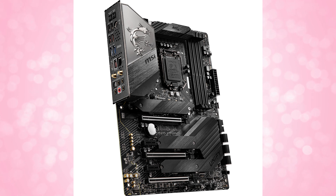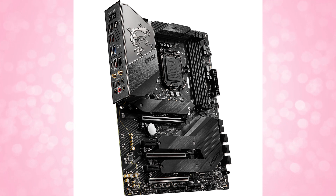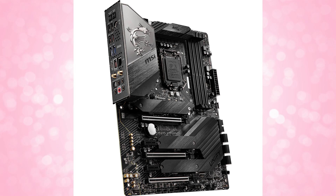While you do have your motherboard inside your computer that has a bunch of integrated circuits soldered onto it that let it talk to other devices like your graphics card, all of your hard disk drives and solid state drives are really friendly with the motherboard. But other devices don't have readily available circuitry already installed on a computer's motherboard to allow you to use them. So when it comes to these kinds of devices — things like sensors or actuators, things that you will mess around with if you are doing some kind of mod or hardware hack — you need an extra piece of hardware to let those products talk to your computer. And in this case, a host adapter fixes that problem.